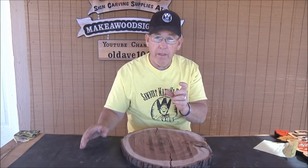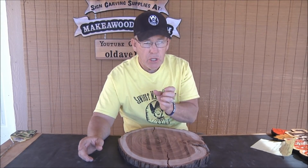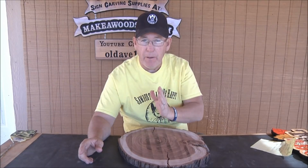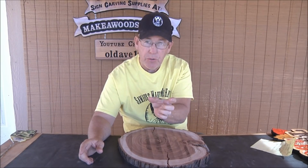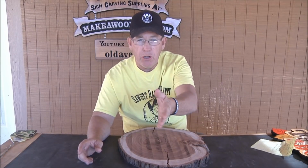Hey guys, all right, so I hope that demo was helpful for you. We're still learning a lot about how to use the router sleds, but pretty happy with that big cutter. One of the things that I didn't talk about on today's video was that you want to take just about half of a pass at a time. That cutter is 2 inches wide, so you don't want to go more than 1 inch wide on your passes